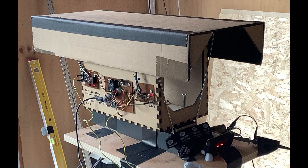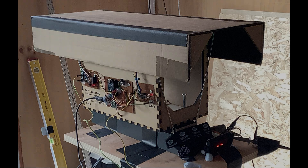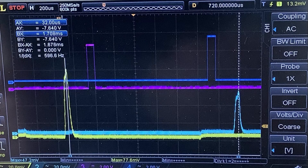To test accuracy, I put a homemade chronograph inside the Chinese chronograph. The distance between the sensors on the Chinese chronograph is 287 millimetres. The distance between sensors on the homemade chronograph is 200 millimetres. As you can see, when a bullet goes through the beams it leaves a trace on the oscilloscope with extremely accurate timings. This allows you to calculate the speed.